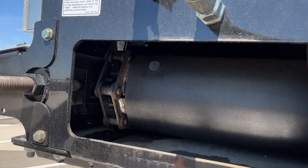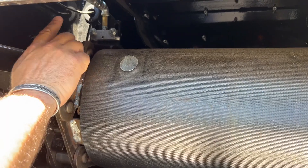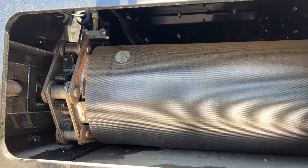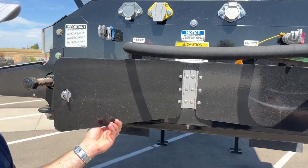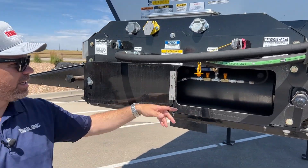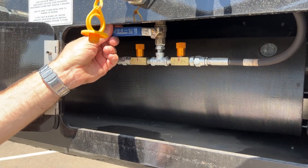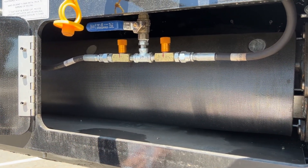When you look on the inside here, you have your roller chain right here, but then up in here there's an automatic oiler. What that does is automatically put hydraulic fluid onto the chain. You can kind of leave it on all the time so it's doing a continuous drip on the chain, or you can adjust it to do it a little bit more at one time.